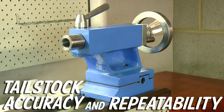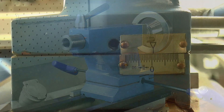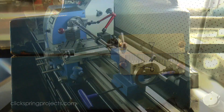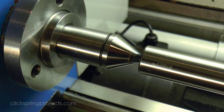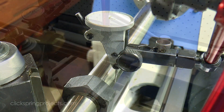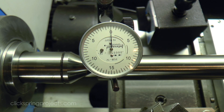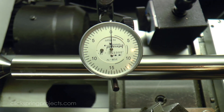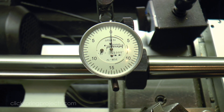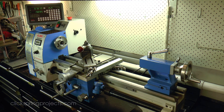In my experience this is the great weakness of the import lathes, and it's a difficult one to properly fix. So I'd suggest when you've got it down to a shortlist, be sure to do some serious digging on this subject, to see what other owners have to say about their machines. It does seem as though the larger machines are less prone to the issue, and my own experience bears that out. The blue lathe isn't perfect, but it's streets ahead of the red lathe, and really the only difference is size — it's bigger, wider and heavier, and that seems to make all of the difference. It's going to really bug you if you get a weak tailstock, so do some homework and see what you can find out about the machine that you've got your eye on.